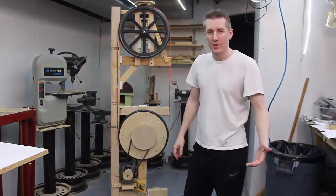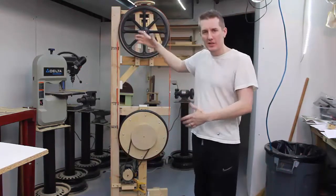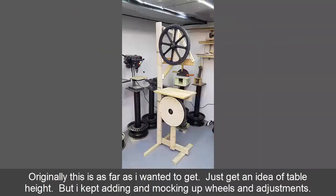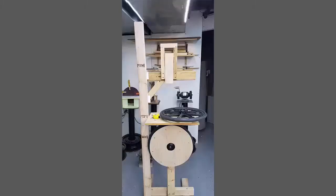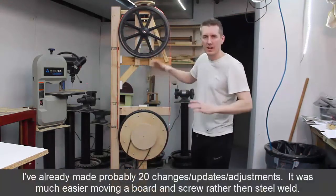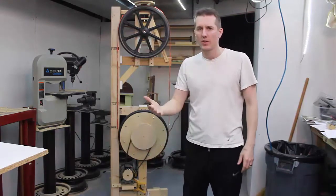The initial mock-up took me only about 30 minutes. I just screwed everything together. I'd already drawn it on paper but wanted to actually see it. I didn't plan on building it to actually work — I just wanted to get an idea of size, how high it should be, how long it should be before making it out of steel. Because if I welded it up and it wasn't right and had to knock it back and grind off welds, that'd be a lot of work. With this, if something's wrong, take off two screws, move something over and it's fixed. When I make it out of steel, I want to know exactly what I'm cutting — cut stuff once and weld it once.